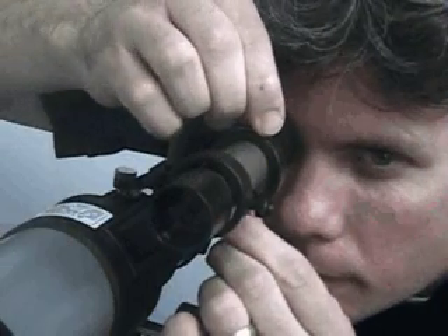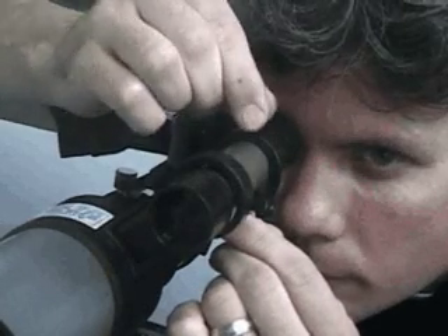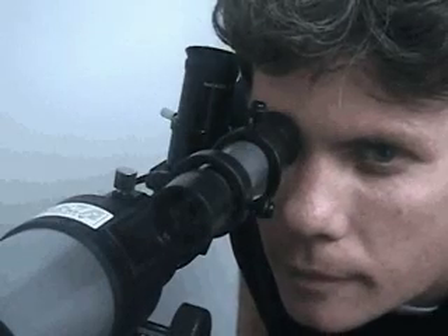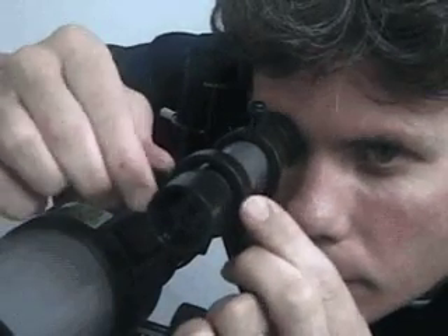While looking through the viewfinder, simultaneously tighten and loosen a pair of adjustment screws so that the viewfinder's crosshairs point precisely at the same object as centered in the main telescope. If you need more adjustment to center up the target, choose another pair of adjustment screws.